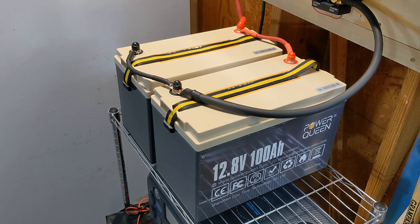I have run a load test on this system for about 5 minutes. I ran it up to about 2,000 watts, then I used an infrared thermometer to go around and check all the wires, all the connections, every piece of this system, and it did not get very hot. I think I got up to a little over 100 degrees after running for 5 minutes, and that's an acceptable range.